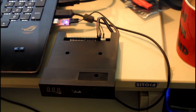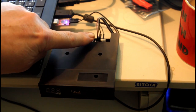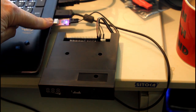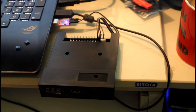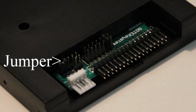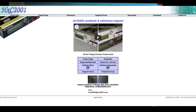Once you've sorted out your driver from the Silicon Labs website, you've got the GoTek drive with send, receive, and power at the back connected to your USB to serial adapter. One confusing thing: when you look at the front of the GoTek there are no lights on, and you think something's wrong. Basically, when the programming jumper is in, you get no display — but trust me, the GoTek is on and ready to be flashed with the new firmware.